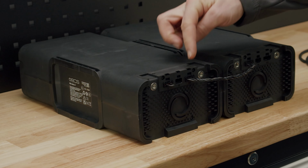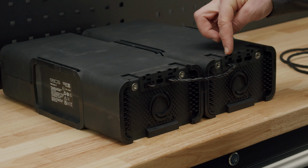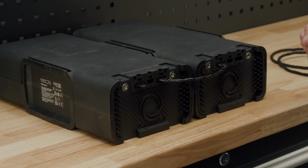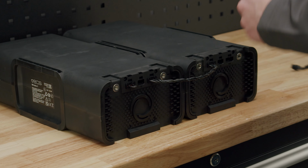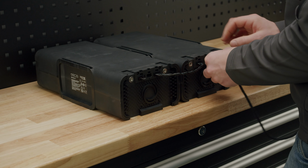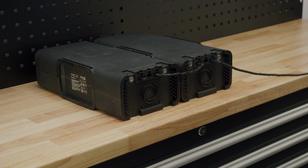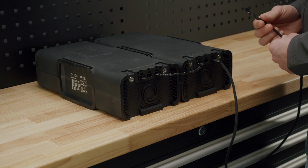As a side comment, it doesn't really matter on which of the two communication interfaces it is plugged in, as long as each side of the communication cable is plugged into the respective battery. If communication further to the outside wants to be added, another cable can be connected into the external device, for example, BOS Connect. If not available, connect a resistor.